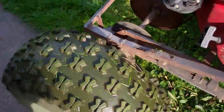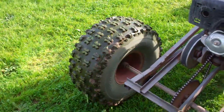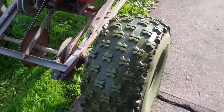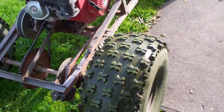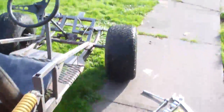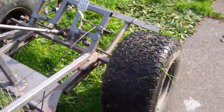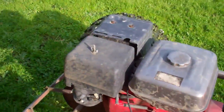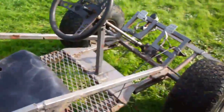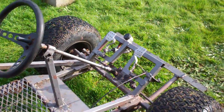This is a solid rear axle, so every time I turn, one of these is scrubbing because they have to turn at the same speed. Going around a turn, the outside wheels need to turn faster, so if they can't, one wheel is going to have to be sliding. And now with this mechanism causing one of the front wheels to slide too, half the wheels are not rolling straight. You can definitely notice it slows down in the turns.